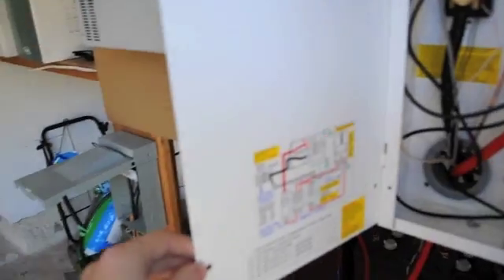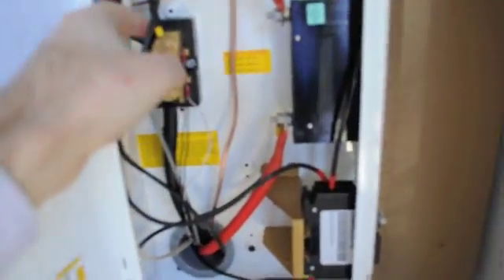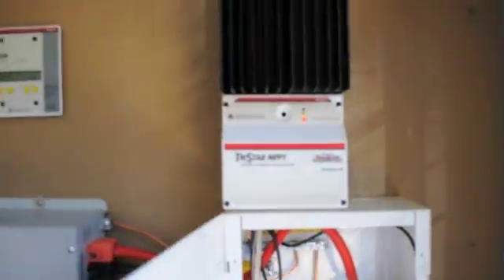This is how it's wired inside the combiner box — I won't go into full detail or it'd be a very long video, but it's documented inside the box. It took some doing and some reading but it wasn't too complicated. I've got two breakers plus a main, and then a shunt. The shunt is what you need for the Bogart Trimetric monitor, which is inside my house in the living room — I'll show you in a minute. I've got everything grounded: there's a ground bar, a ground from the inverter, and a separate ground from the panels.